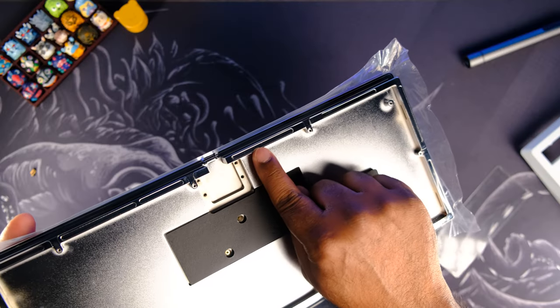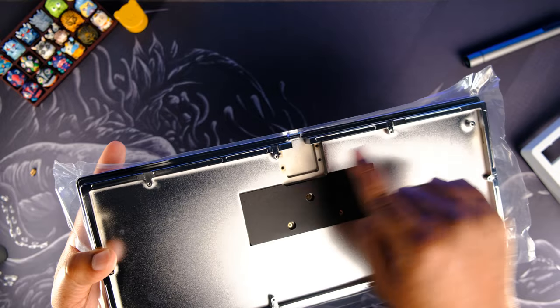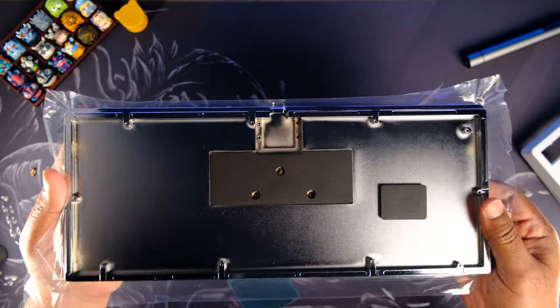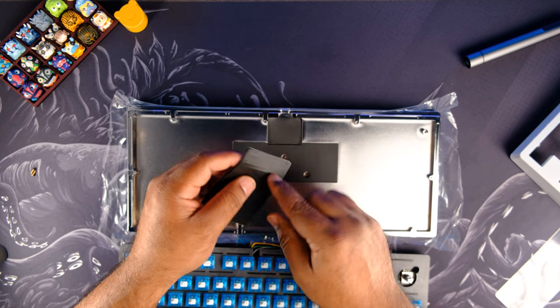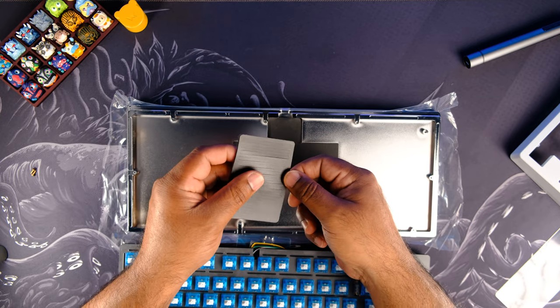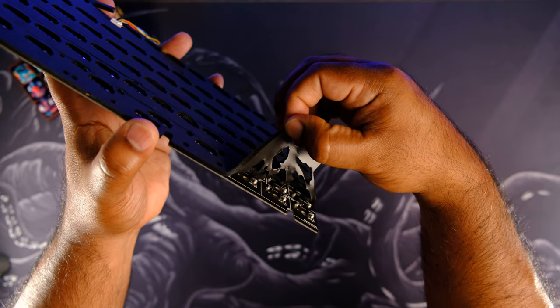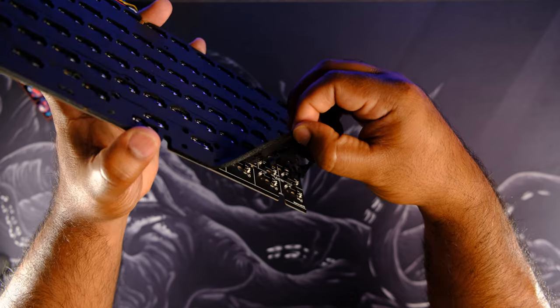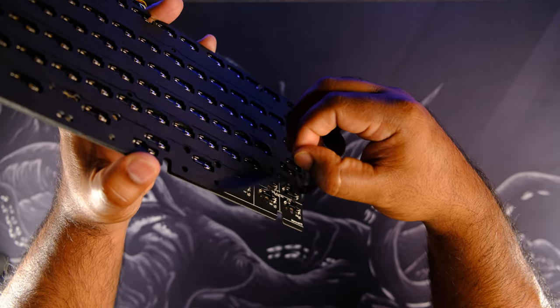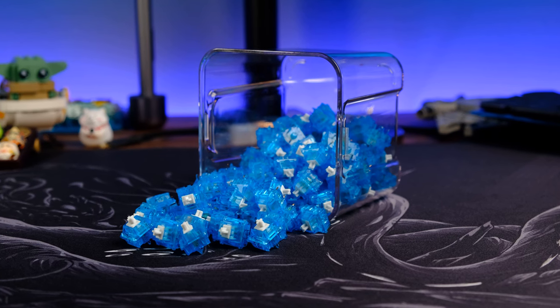Now, option number two is where you install the gaskets on the bottom of the case. I'm not gonna do that in this video. I will do a second video to show you how that works. But what you'll do is simply take the gaskets off, place them in the little grooves that they already have ready to go. You can take off the PCB foam that's at the bottom. I would probably recommend putting some polyfill or something in the case just so you don't get shorted, and you're good to go. The switches we're gonna be using today are these SP Star Soda Series